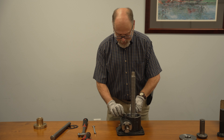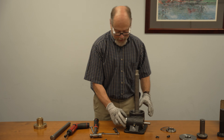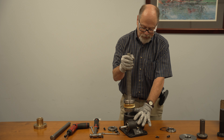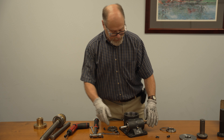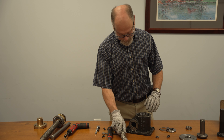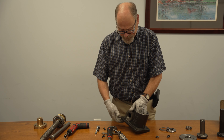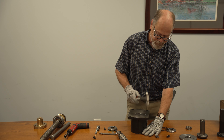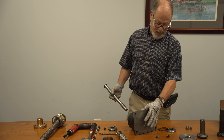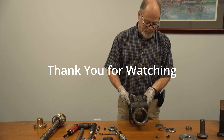Next we'll go ahead and break free the bolts on the flanges. Normally with your gear, you can just grab the screw, swing it around, and pull it straight up out of the unit. Then pull the worm out. The races are in there — sometimes you have to tap them out. Then basically just take your race out if you want to replace it. That plug for dirt should just knock right out. Comes out and there you go — just the same five-ton unit.